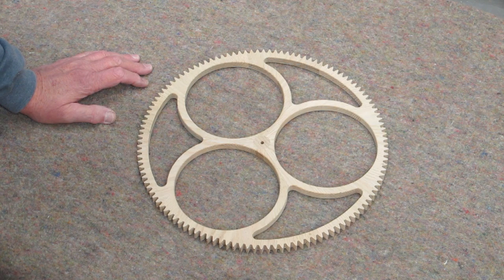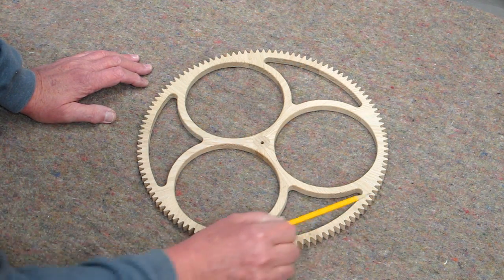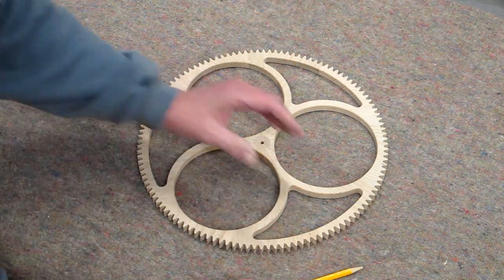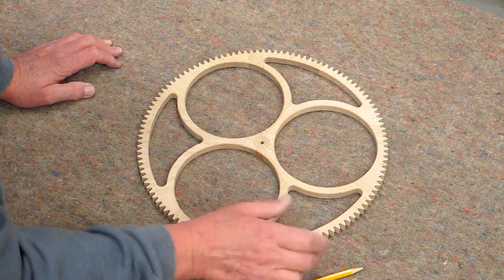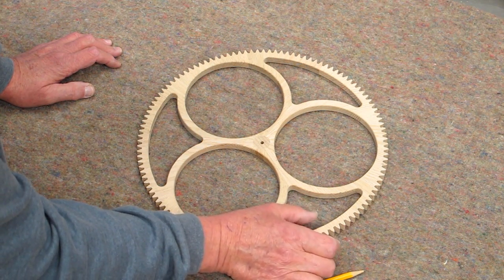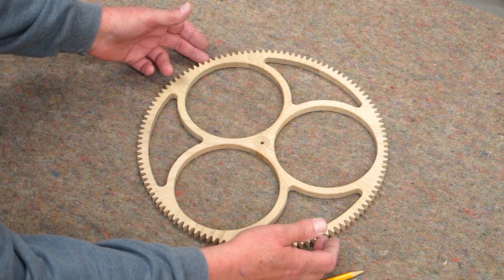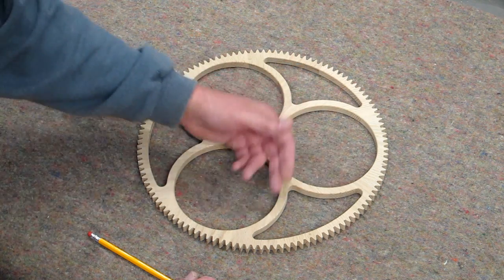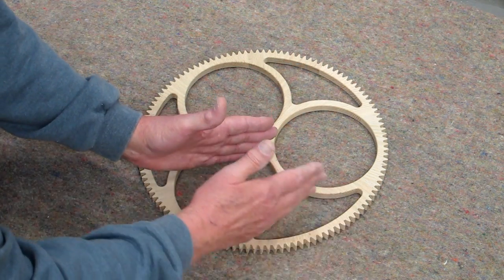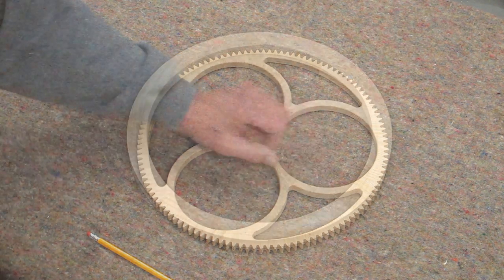So in a perfect world, how would we make a wood wheel to be as stable as possible? In the rim area, we would like the grain to be circumferential, running this way. There wouldn't be much deflection in that wood — it's not very thick here, so a small change in this dimension isn't going to have much effect on the operation of the gear or the clock. And the wood coming out for the spokes would be radial. It's not going to change much in this direction, and there's not much thickness here for it to change.